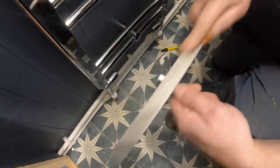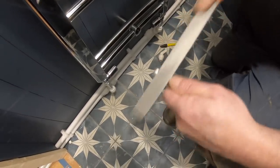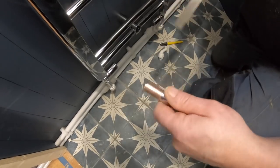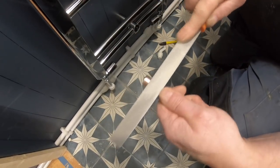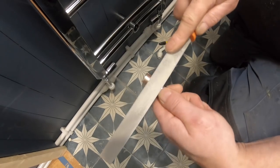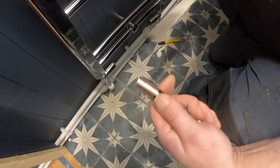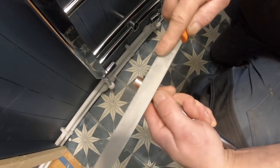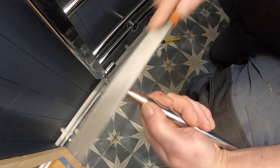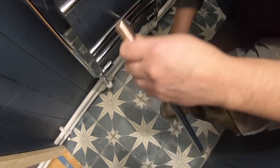It's first thing Sunday morning and the radiator install vlog has just been posted. We had a comment straight away and a couple of other comments about chrome pipes going into push fit fittings, and really I should have thought about it but didn't, but yeah, there we go. So first thing today is to just rub down a section of chrome off the pipes.